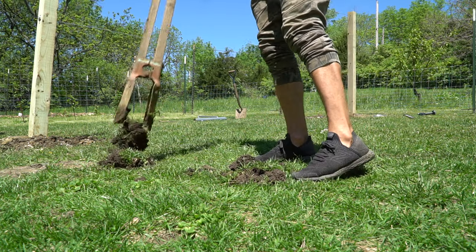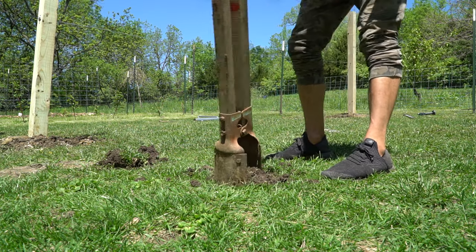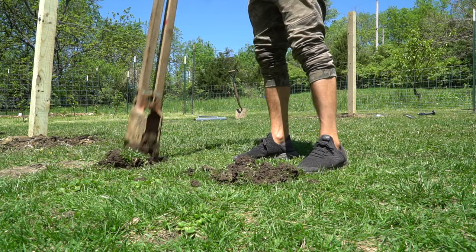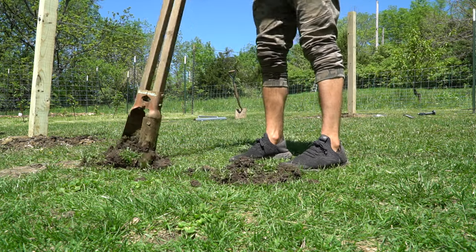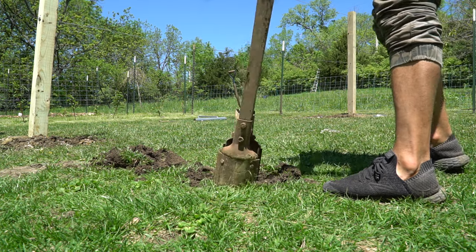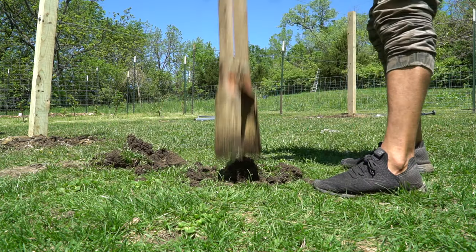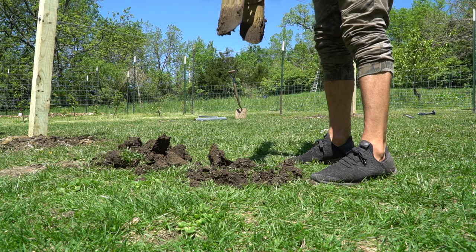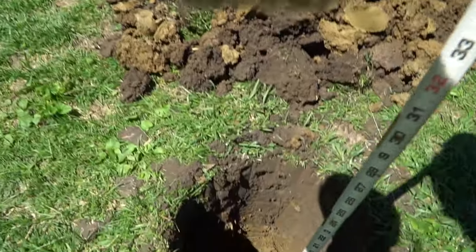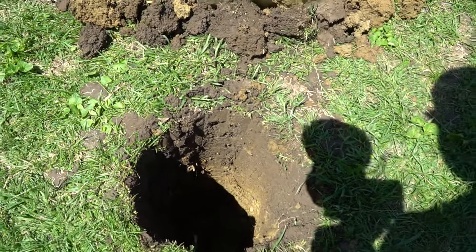When you're digging a hole for these four-by-fours, you want a large enough diameter that you can get in there with a rock bar. You want a wide enough area where you can work and pound the dirt back, because we're not going to be using cement for these holes. We're just going to work with the soil we've got — we'll put a little bit of drainage rock in there. That's how I typically set my posts. Now we have our hole at 30 inches, so the first thing we're going to do is dump some drainage rock down in there.